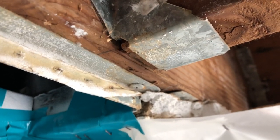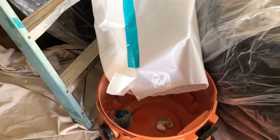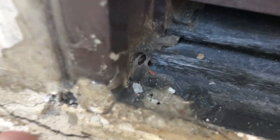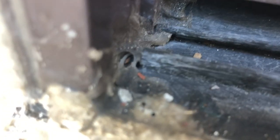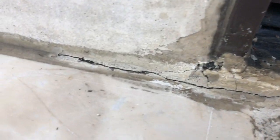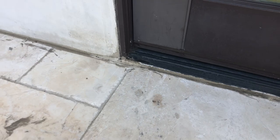We do have a drip coming — you can see it's funneling down this tube. This whole area here is the cause of all that water damage down below. You can see they applied the wrong caulking — it's not doing a good job with sealing. So we're gonna go ahead now and set up our dehumidifier downstairs and start drying out the structure so we don't get any mold or bacteria. That concludes the finding of the leak.